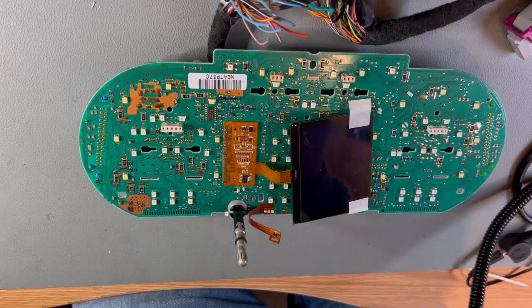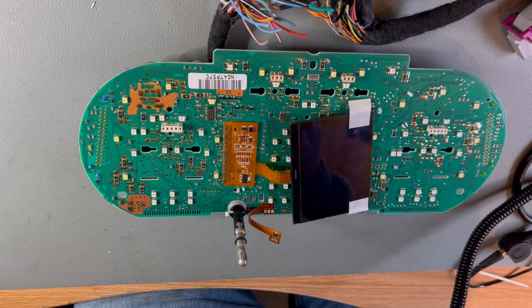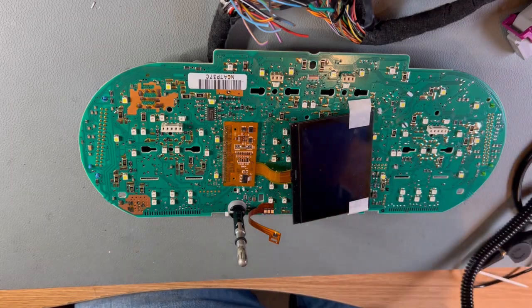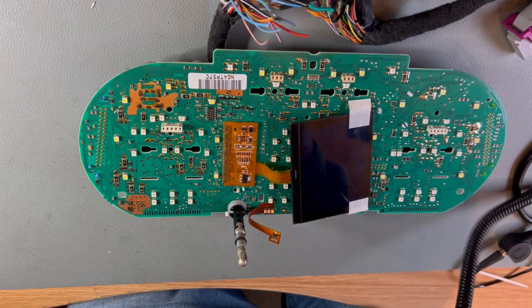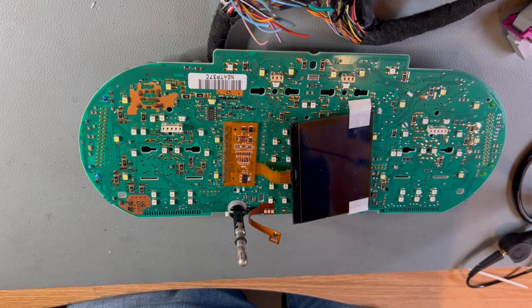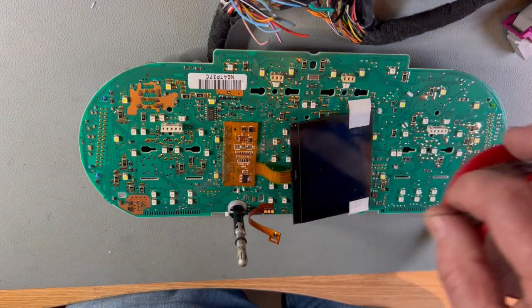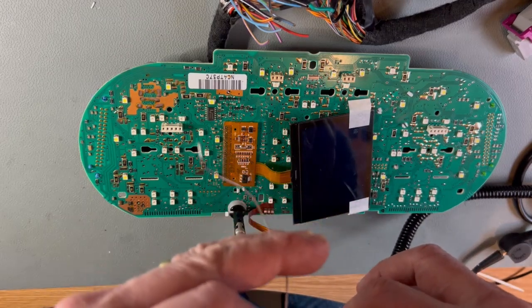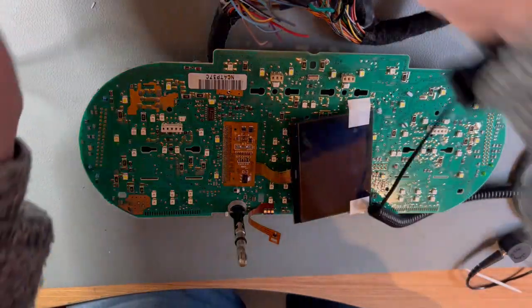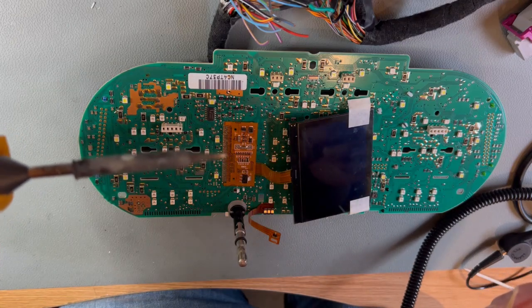As this video is primarily focused on soldering, I'm going to show you the technique I use to resolder these surface mount components. Generally, we do not apply solder — you don't have to. If the joint looks very dry and there's no meniscus at the end of the component, then apply a very small amount. We advise using a half-millimetre solder — this one is leaded solder because it's more compatible with older electronics. The fine wire is important so you don't over-solder the joint. Use a half-millimetre soldering tip and just keep the tip clean, retinning it once in a while.